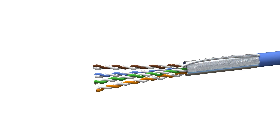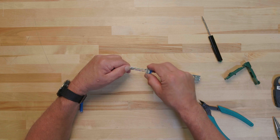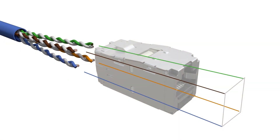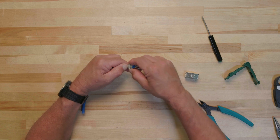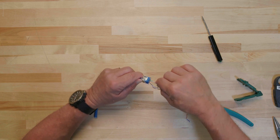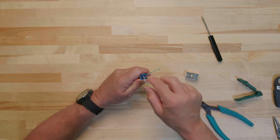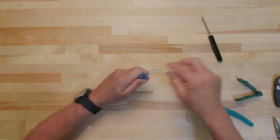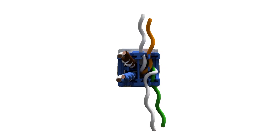If you notice that the gap in the foil is positioned between the wrong conductor pairs, snip approximately 2 inches off the cable and start again. When terminating cable end 2, position the cable so that the brown and green pairs are oriented in the same direction as the strain relief, the catch, and the latch, and insert them into the wire cap. Be sure to always maintain this orientation and positioning throughout the entire termination process. Continue to follow the same steps as cable end 1 until the strain relief has been depressed. Before we untwist and seat the conductor pairs into the grooves of the wire cap, we need to reposition the conductor pairs on cable end 2 so that they map properly to cable end 1. When routing the conductor pairs, cross the orange and green conductors around the post with the green pair positioned to the outside of the post.